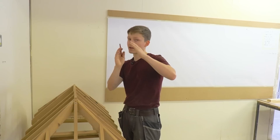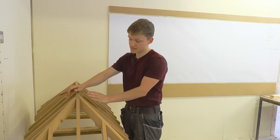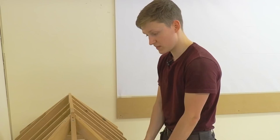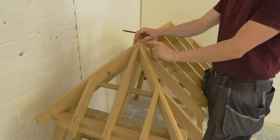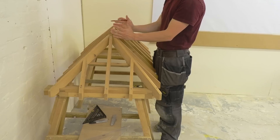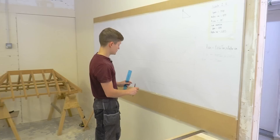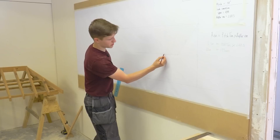If you don't put them exactly on the center line, you'll find the bottom of the hip rafter's plumb cut won't be touching the ridge board - you might have a 5 or 6 degree error. That's why the end commons are always placed the rafter run back but dead on the center line. It's a bit deceptive - a lot of people would put the end common to the left of the rafter run mark. By doing it correctly, the crown rafter ends up the same length as your common rafter.